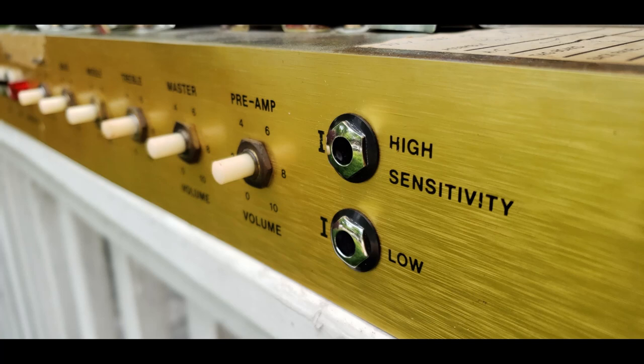And due to the way it was built and forming voltage dividers, each channel had a lot less gain than a 1987 single channel. And even if you were to use an AB box and jumper and use both channels at once, you still had less gain than a jumpered 1987. And certainly a lot less gain than the cascaded 2203 100 watt. So in 1977, Marshall did add cascaded gain to the 2204 and has retained it all these years since.